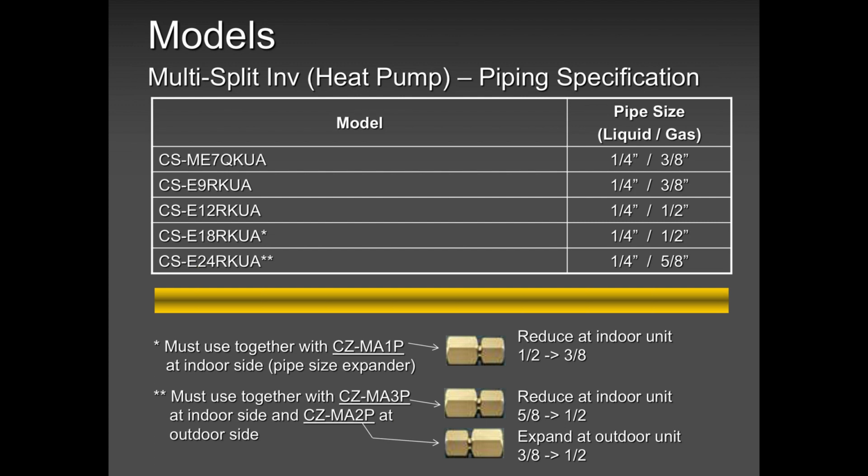Because of the diameter of the pipe and the length that he went, it was enough to show the outer unit was low on refrigerant, lacking some refrigerant. So please, he got away with this, but I don't know how long it's going to last. I mentioned to him, at some point, you will have to rectify this issue. Now, whether he's going to rectify it or not, I don't know. But I've kept a note just in case the compressor fails at some point.